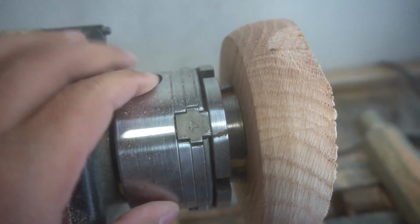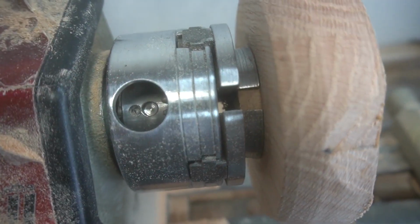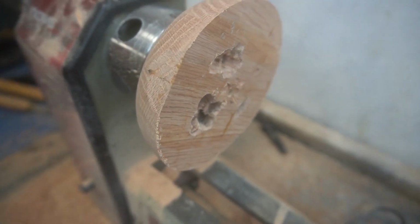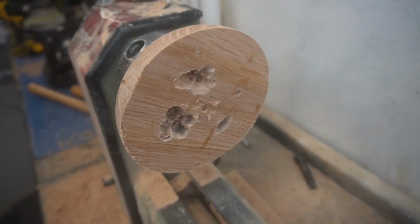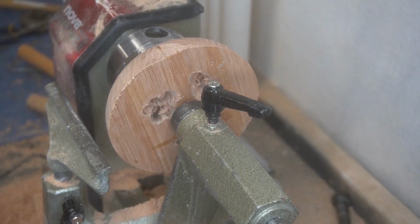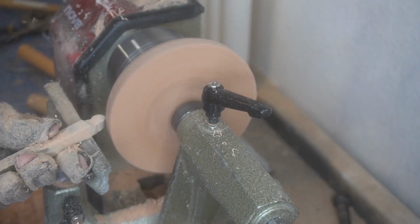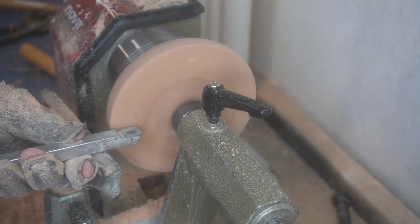So here you can see the tenon, and then I flipped it over. This is essentially what this is. So instead of there being a hole there, that's a piece of the wood that's actually clamped down on the chuck jaws. And now we're going to gouge out this portion of the project. And you can see it's just cratered, and I'm going, oh my goodness, this thing is just going to eat away at it. What I'm fearful of is that eventually it's just going to spin and then it's going to explode on the lathe essentially.